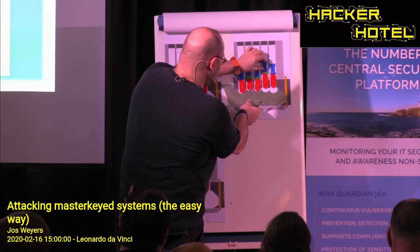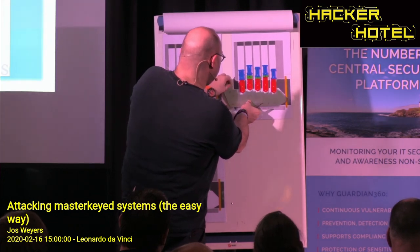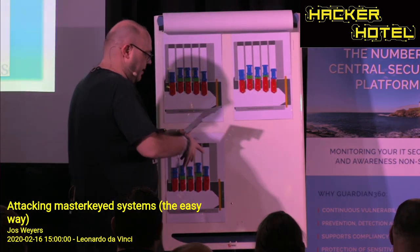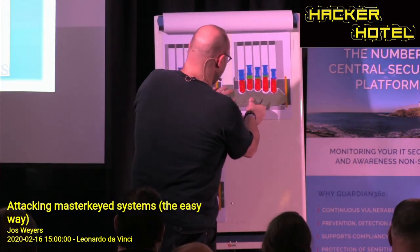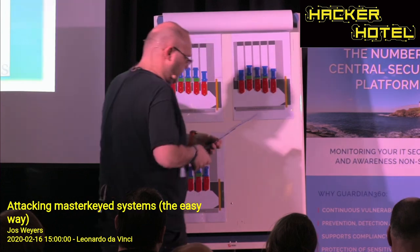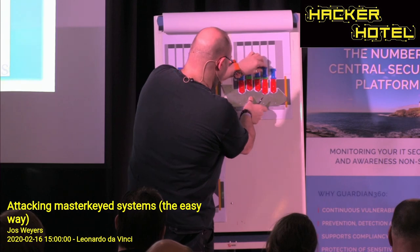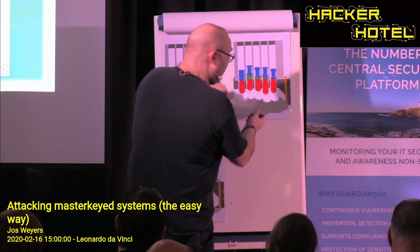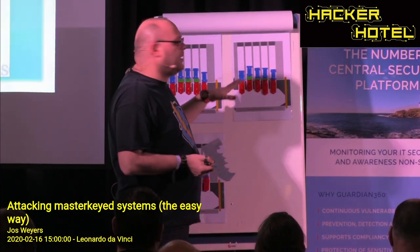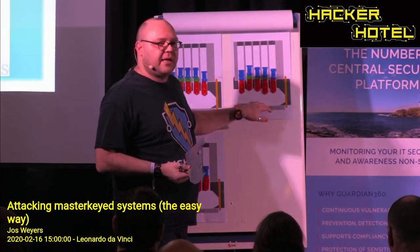Almost. Okay, so nope, that's not opening. So if I start impressioning it, same key on that lock, then it'll mark there. It'll still mark there. That will open. So now we have a second step that is easier because I'm doing less. There are a lot of these pins I haven't even touched yet on the key. So now we have a working key for this lock.